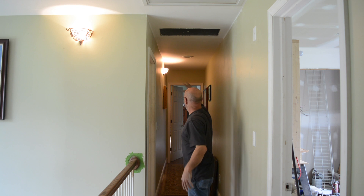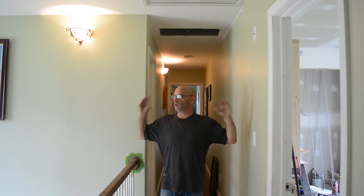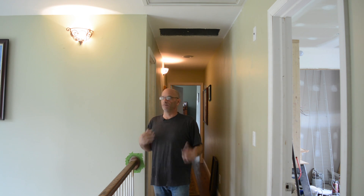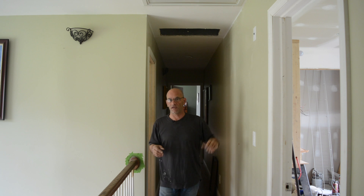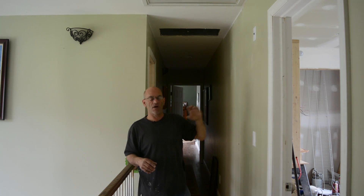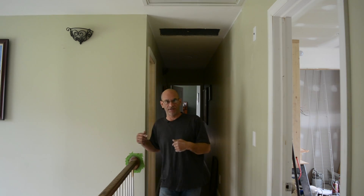There are our lights — we've got one up here for our foyer and one back there for our long hallway, on our sensor here that's sensing the darkness. I actually just turned it on — when you first turn it on it will energize, so if you give it a couple of seconds it'll probably go off. I hope you learned something. By the way, on that photocell — it doesn't have to be a photocell. It could be just a motion sensor or whatever you want, or even a regular light switch. I don't want to see the photocell in the middle of the wall, and that's another reason why I put it up there. If later on I want to put a bypass switch in, I could do that just by going lower here. You could do a bypass switch but you would need a diode in that, because you can't inject power back like that — it's going to feed back and probably screw things up. Anyway, I hope you learned how to do something — I thought it was pretty cool and I needed it here. Thanks for watching.